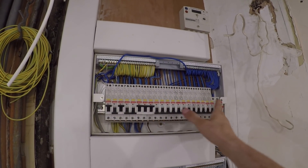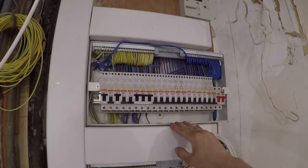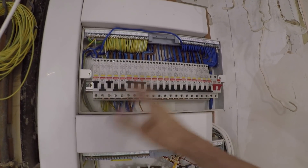One set of tails will go to this board and another set will go down to the board below, because we've got to have one isolator which can isolate all the power in the building. So it's a little bit annoying because it's actually quite neat the way we've done it, but needs must. We've ended up opting for an RCBO board here.